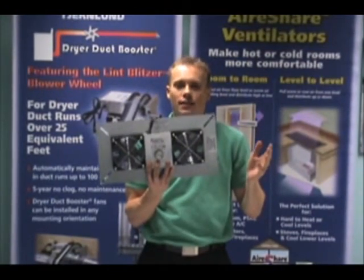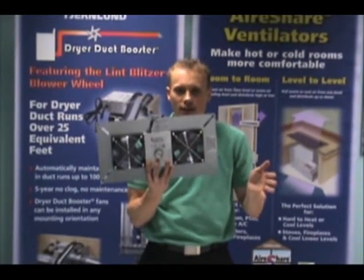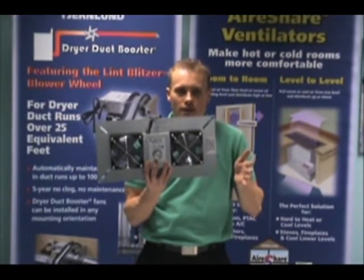The third fact is that one V1D crawlspace fan, 110 CFM, will properly ventilate a 20 by 20 by 4 foot area, so adjust the size or number of fans based on that figure.